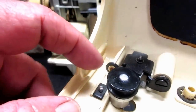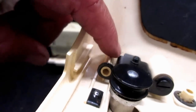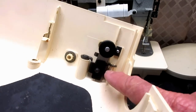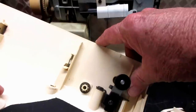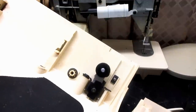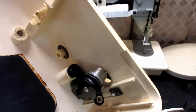This system is held and mounted by this bracket here — mounted by one screw right here, and then a loop that just goes onto the top of a plastic post. It's got a hinge screw on the system, and I think it's got a little spring in there because when you push it one way or the other it actually kind of clicks. But this can also get dry and dusty and dirty. So if I have the covers off, I'm going to take that off when I do a restoration, clean it, and maybe put a little lube on there. Right now the spindle is so hard to turn — it should just roll real free.